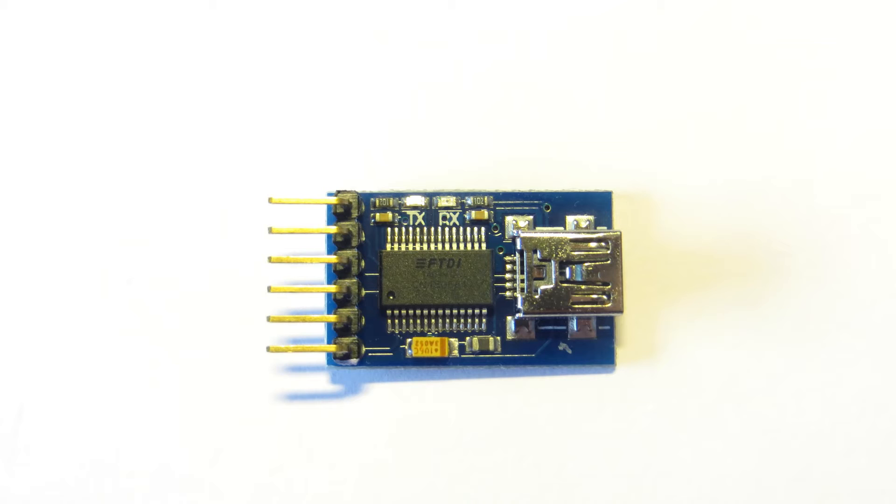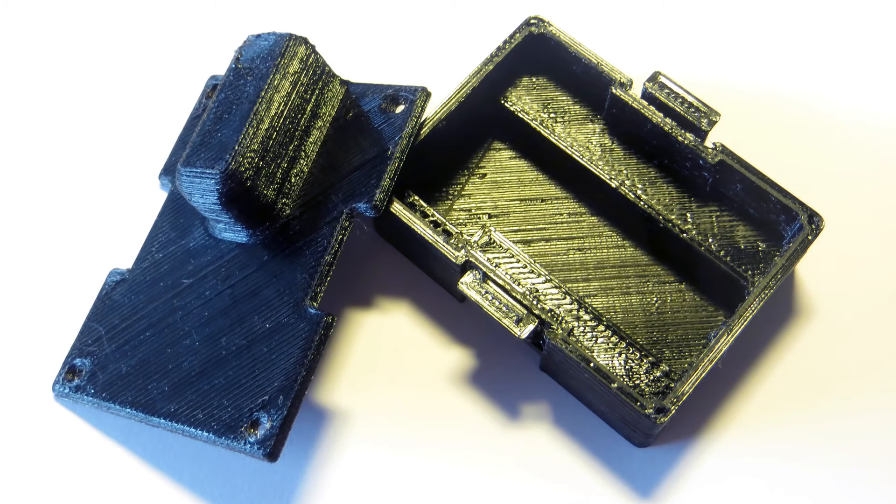There's one important thing to note. You may already have this kind of adapter, but as mentioned, the RF unit only handles 3.3 volts, and most common adapter ports provide only 5 volts. So you need one that you can switch to 3.3 volts, to safely power the target chip. Make sure you are using the correct one, or you will possibly damage the RF unit. As I happen to own a 3D printer, I tried printing a case for this module — you can find it on Thingiverse. There are other options too, but this worked quite well, with some minor tolerance issues.